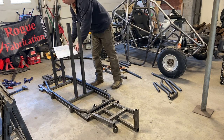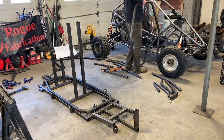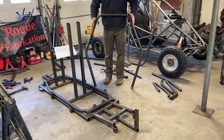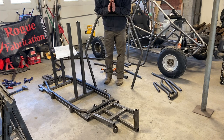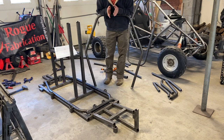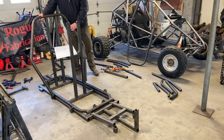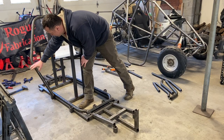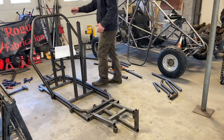The next piece is the main roll bar or main hoop, and I purposely underbent this piece because it's a hard one. There are four bends, and if you don't nail the bends the whole thing is off — even if one bend is a degree off, it's not going to line up correctly. I underbent two of the pieces by one degree to show you how to align parts and make them work. When I put this on, it's about an inch to an inch and a half off on either side — one to two degrees off can affect the bottom significantly. You've got to come up with ways to make it fit correctly onto what you're building.